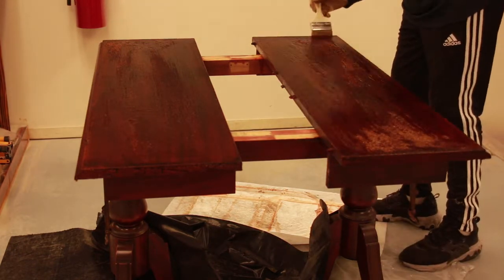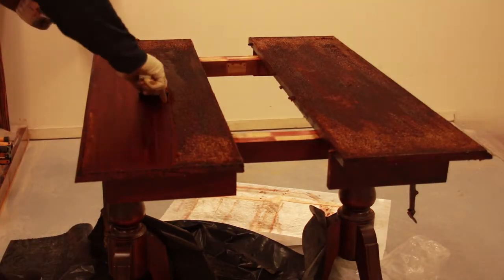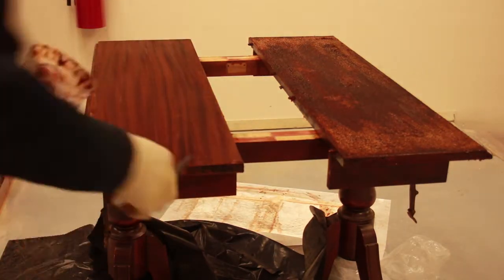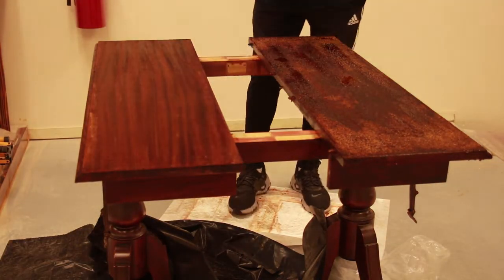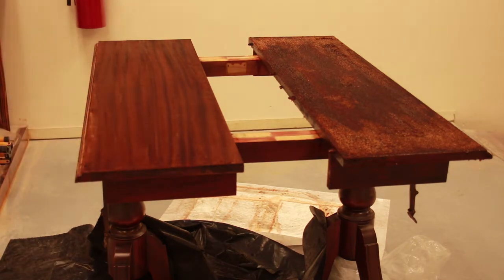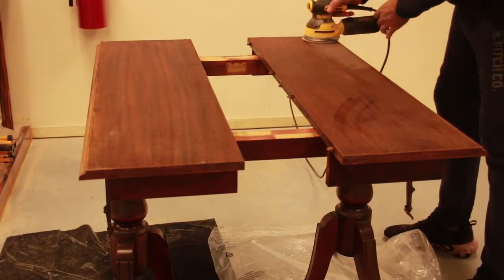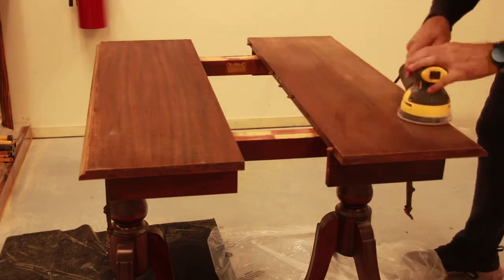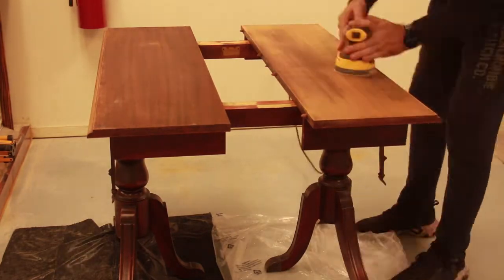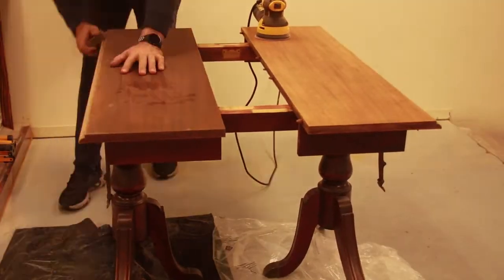This is a different type of finish on here. Usually when I put the paint stripper down it ends up bubbling pretty aggressively — like alligator skin — but this one is kind of shrinking on itself. I don't know if it's because it's an older type of wood finish, but it still came off. As I removed the finish I could see there was a mahogany veneer laid up on pine — at least I believe it's pine, telling from the end grain can be a little tricky.